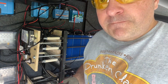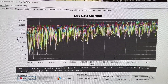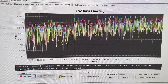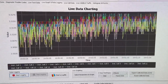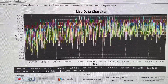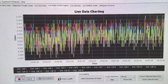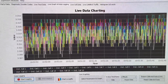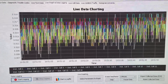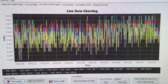It's quite a bit later in the day, but check this graph out — all the lines are really close to each other. Clean your terminals when putting your battery together; it is incredibly important. I'm pretty sure I had this problem because I got lazy and left some lint behind during the original assembly. But this looks so much better — we're within about eight millivolts of each other while under load, which is pretty incredible. If I shut off the load the difference would be even less, though the inverter does induce a slight AC waveform on the DC battery.